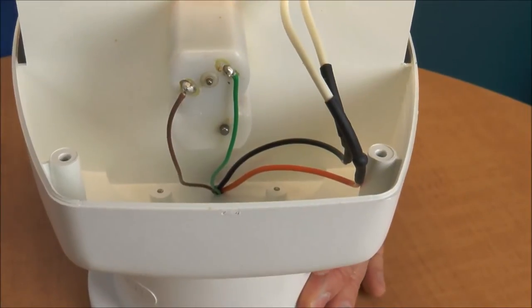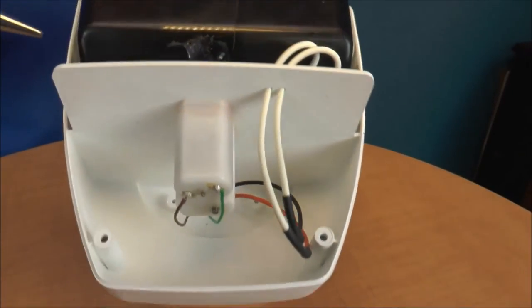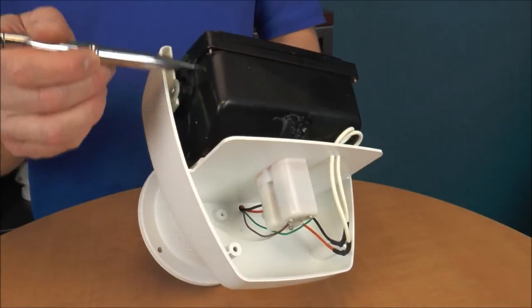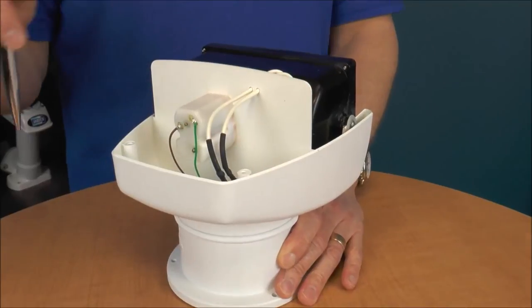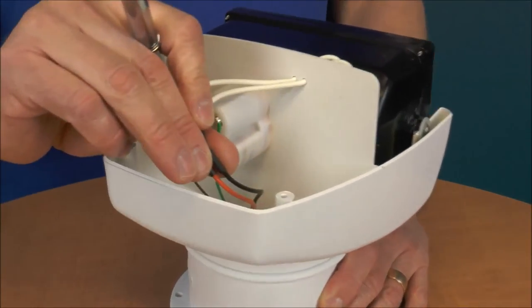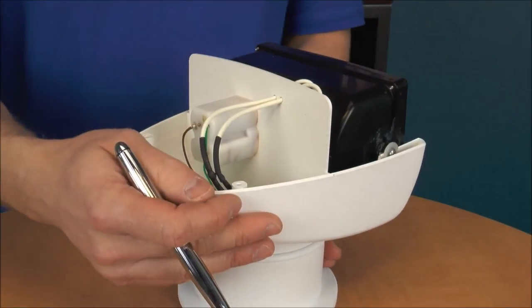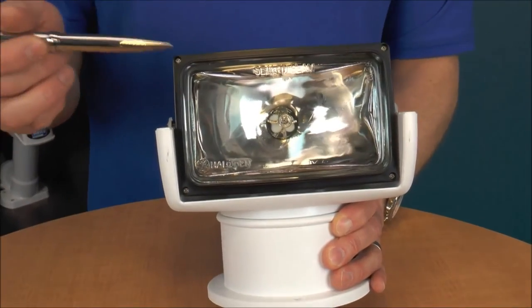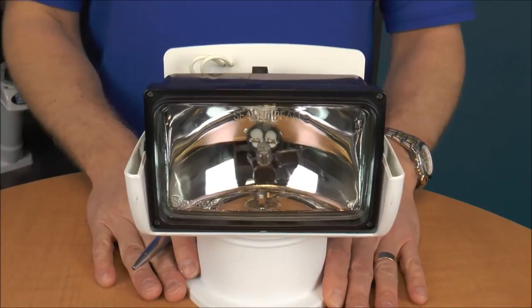Through the shield — this is a water shield so that water doesn't get into the motors — you'll see the bronze gear assembly right in there, and that's what makes the light go up and down. It actually moves this entire housing. To power the light, there's two white wires that come out of the light housing assembly — they can be either brown or orange, it doesn't matter. The light itself isn't polarity sensitive. To change out the light, you'll see four screws on the front bezel. Remove those screws, this plastic housing comes off, and then you get access to the light. That's the 135 in a nutshell.